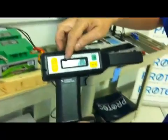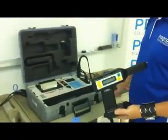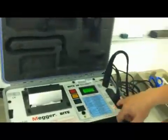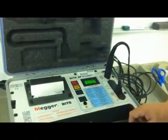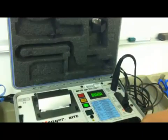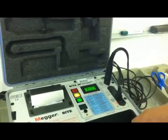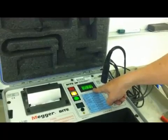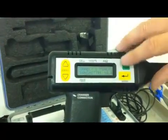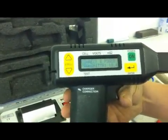Now it's going to say connect and power up the transmitter. I've already got my transmitter connected, so the next step is to power it up. I'll wait for the current ready lamp to illuminate. I push the current button — it is now charging the internal capacitors. When the transmitter is actually transmitting, we will see the current ready lamp come on. We are putting out 11 amps of AC current. The actual current flowing through the battery string with all of the combined losses is 10.4 amps. That is my test current; I push the trigger and capture the value.